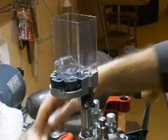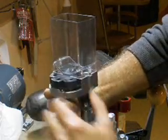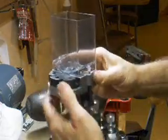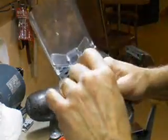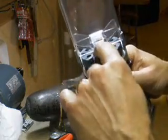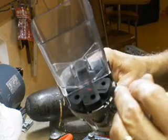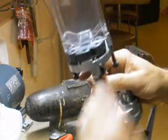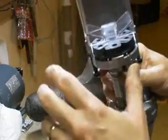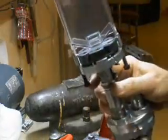This will tighten up. You don't want to get it too tight, because remember, we want to have these screws completely secure and still allow this freedom of movement to occur. Okay? When I got done, I was able to bring the tolerance down, because there needs to be some play in there. I was able to bring that down to 1/1000th of an inch clearance between the powder hopper and the disc. Okay? How did I check that? I have a piece of shim stock that's 1/1000th inch thick, and I could slide it in there, but it was tight. So we're really talking about between 5/10,000ths and 1/1000th of an inch.